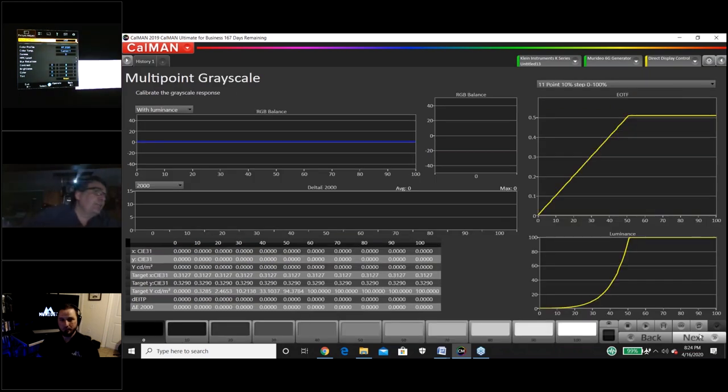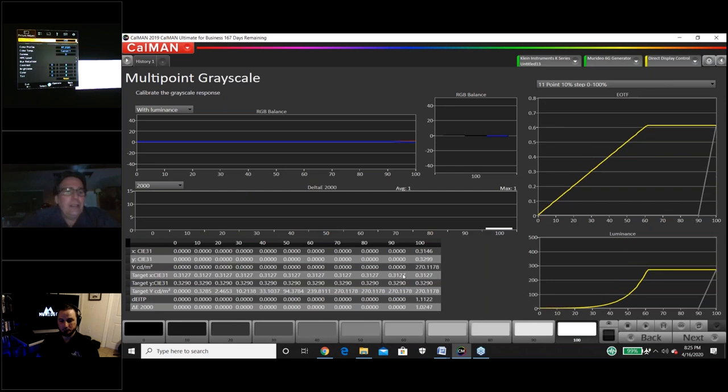So that is as bright as this display can get right now. I'm just gonna do a quick reading here. I'm actually shooting 270 nits on this projector, which is really bright. And this is a Screen Innovations screen. It's 12 foot, 2.4 aspect ratio, and it's a 1.3 gain Screen Innovations, so it has a positive gain. It's a pretty bright screen, and you want all the light output you can for HDR.